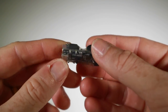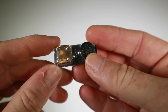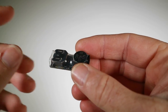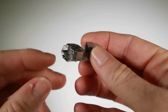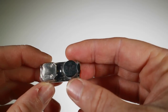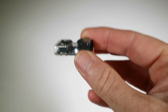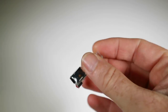Welcome to the wonderful world of close-ups where I've got the little Drone Keeper Mini 2. I've put the cell battery in - this is an LIR1254 rechargeable cell. One thing to know is that you must use a rechargeable cell; you can't use disposable ones like with the previous model. When you switch it on you get three beeps - there are actually three different things it's beeping for. The first beep indicates it's in wireless mode; two beeps would mean wired mode where you'd have a PWM value going in via the lead. The second beep - the default - is how long it will go without movement before beeping, set to 30 seconds. The final single beep denotes how long it will go before it starts beeping anyway regardless of movement - that's for situations like when your quad is stuck in a tree swinging around - and that by default is 20 minutes.